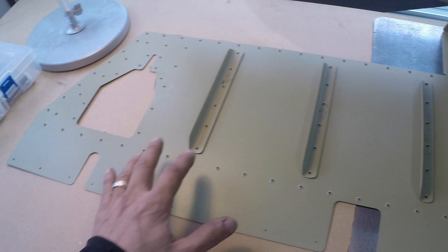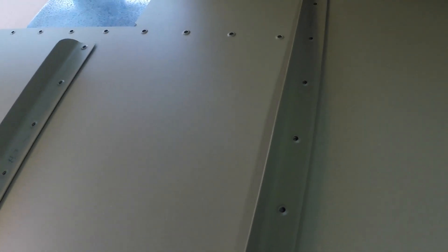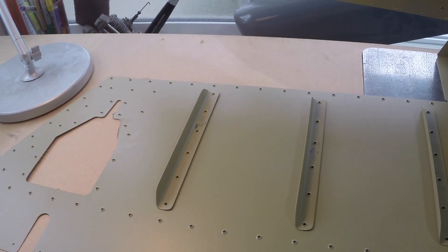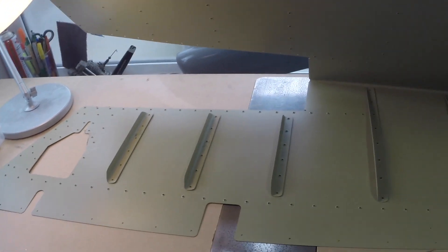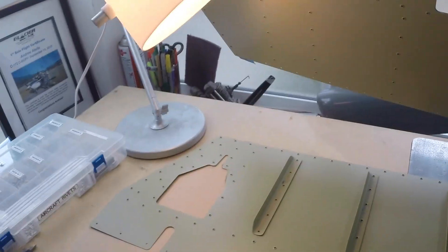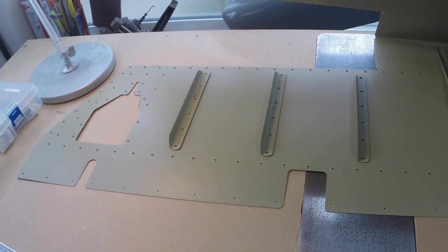We're about ready to go and everything's fitting great. You can see the labels come right through the AkzoNobel primer so I still know where everything goes. I've got my rivets all set up. I'm going to double-check the plans and grab a test piece to do a couple of practice runs first before digging into the real elevator skin. I'm starting with the bottom of the skin — the top visible edge we'll do once we have some practice back riveting.